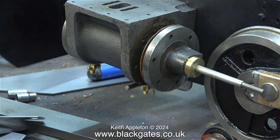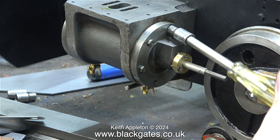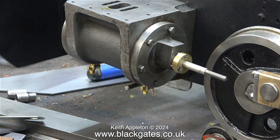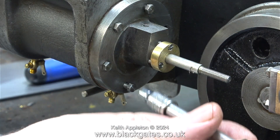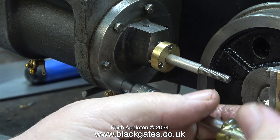Once the cable ties had done their job and the pistons were in the cylinder, I simply cut the cable ties using a pair of side cutters, then threw them in the bin — and I mean the cable ties, not the side cutters. With the piston in the cylinder, here I'm tightening the bolts that hold the cylinder cover to the cylinder. The rear cylinder covers which incorporate the glands will only fit in one position, because the central register on the cylinder cover engages with the bore of the cylinder.